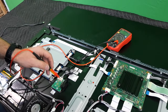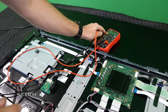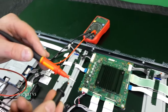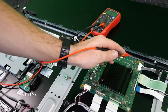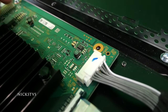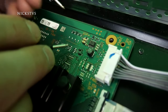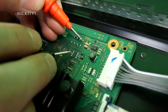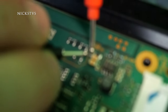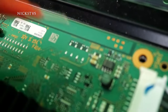I just unplugged the TV from power and I've switched my multimeter over to beep mode, so when my leads detect a short it beeps. Now let's take a look at the DPS board. Zooming in a little closer, there are a few things on the top right corner that we want to focus on. The first thing we're going to do is look at our fuse — it's very small — and we're going to make sure it's not shorted. And it is shorted, which means it is a good fuse, so that's good news.